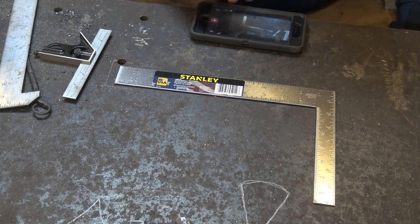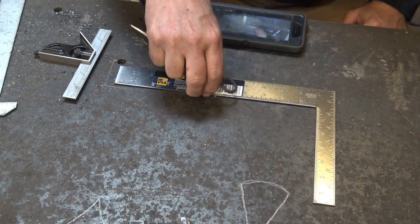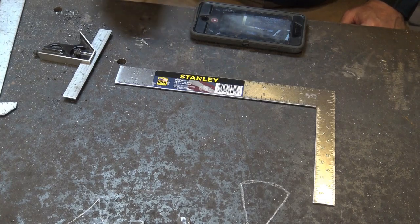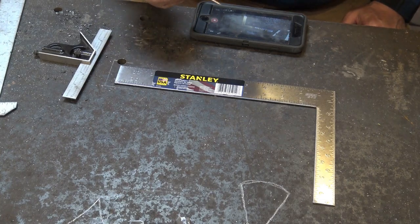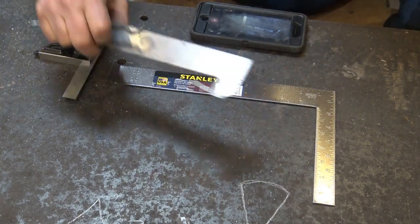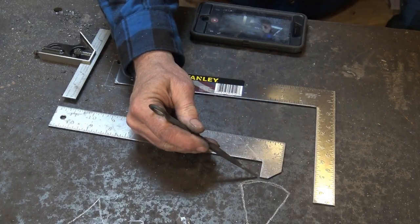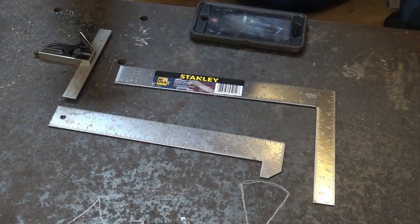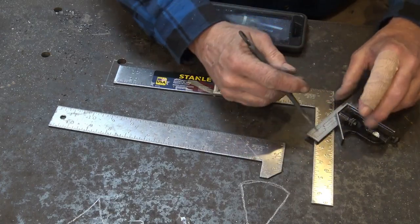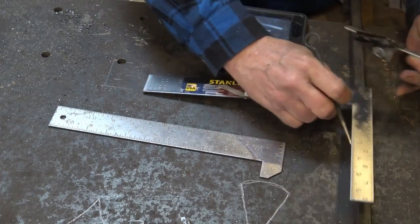These are super simple to make. It's just a matter of cutting the extra leg off — you can cut it off anywhere you want. I think it's handier without that leg sticking out, partially because I can stick it in my back pocket. I like to go from the 2-inch mark so that I have a 2-inch back section, and I like to have the 1-inch here. Those are handy measurements to just have as quick references. So I go from that 2-inch mark and cut a 45-degree angle, propped up on something.